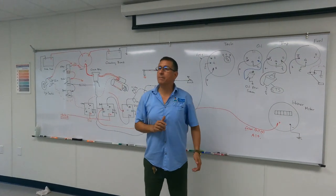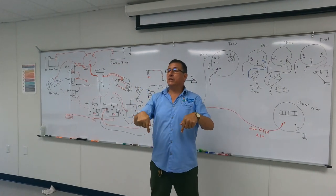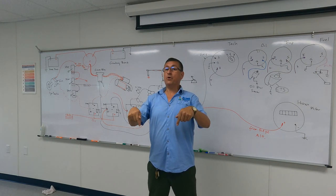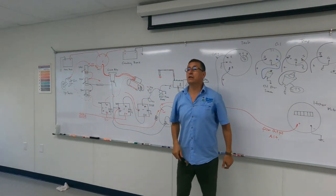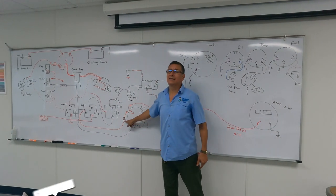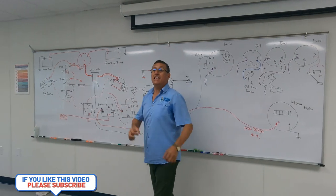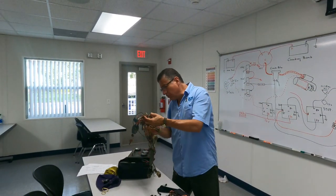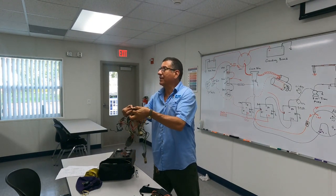My alternator is damaged. Or, pay attention. I check the battery with the engine off: 12.3. The engine starts: 13.6, 13.7. My alternator is working. However, here, I don't receive extra current. Where is the problem? Diode. The diode is open, and the current does not flow. It's very common. Where is that diode located? That diode is located in the harness. You need to open it and discover where the diode is.